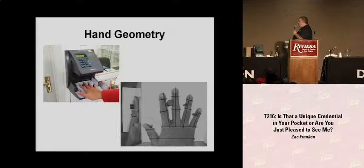So there's normally something to help you line up to kind of interface you with the digital world. So in this case, you have a set of pegs. You have a set of little lights on the reader. And when you close your hands up around the pegs, the lights go out, and when you get all of them out, it takes a reading. And it's just an image. The base of the platen is highly reflective, and there's a camera, or there's a set of mirrors, and there's a camera here, 45-degree mirror, and it takes an image of your hand on this platen.